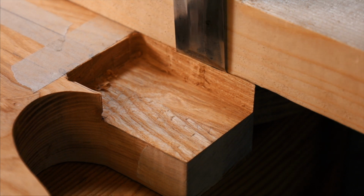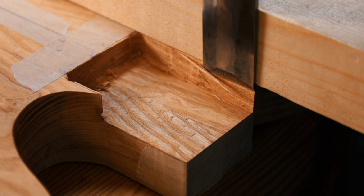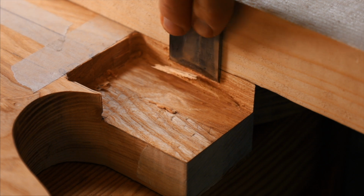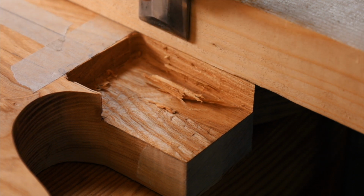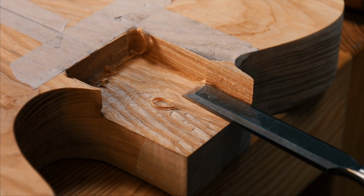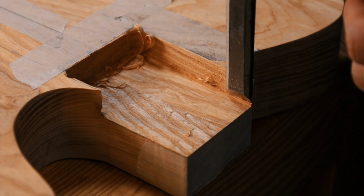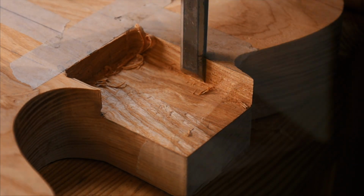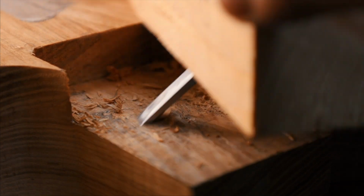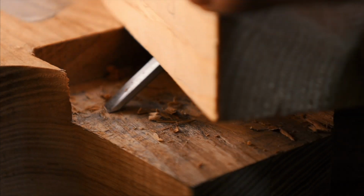For this side, you can use a square piece of stock to guide the chisel, so it's perfectly straight. Because you're cutting with the grain, the risk of having your chisel tracking the wood fibers is very high, so be very careful while doing this. Now that the sides are clean, you can use the chisel and clean the bottom. I used my poor man's hand router again and made tiny cuts to get to the desired depth. This technique also makes sure that the bottom of the neck pocket is now parallel to the top of the body.